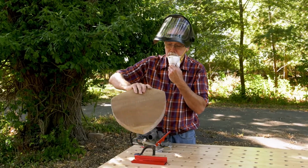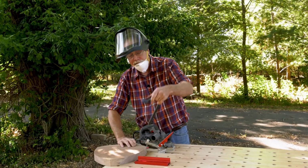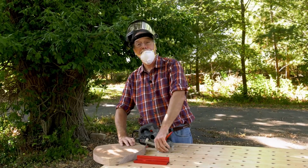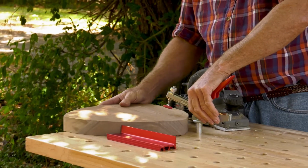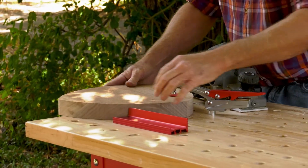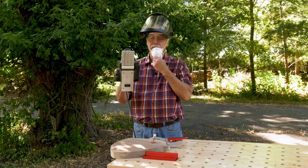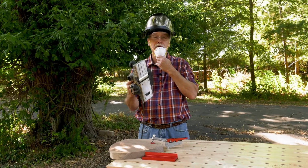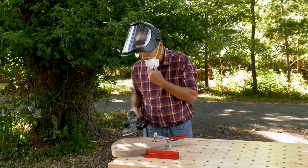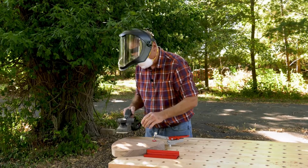Once the holes are drilled in the workpiece, it's time to sculpt it. So holes down, and this is called a hold fast. We don't need that because we have this. Does the same thing. Auto adjusts to hold workpieces. We have a fence that this toggles against. And instead of the belt sander that I mentioned earlier, we're going to use a power planer. The key to using this is light cuts. Keep it moving and sculpt this workpiece down. I have the chips ejected out that direction.